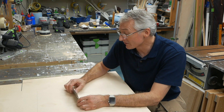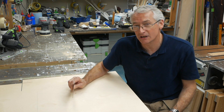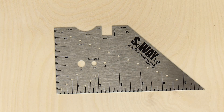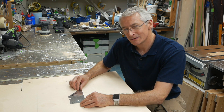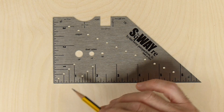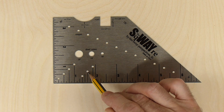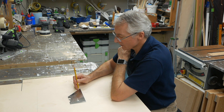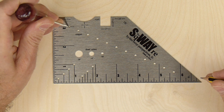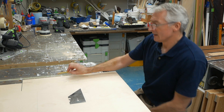I'm really interested in how Tim goes about it. With the square as it is, you've got little holes along it — these are a quarter inch, half inch, three-quarter an inch, and also three-eighth, five-eighth, seven-eighth. You've got half inch holes here and you can put an awl in there and scribe a circle reasonably accurately with it, and they are every half inch.